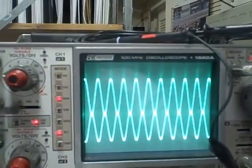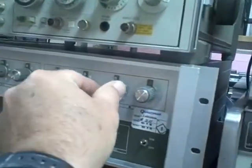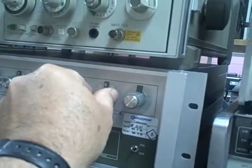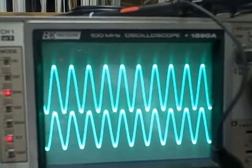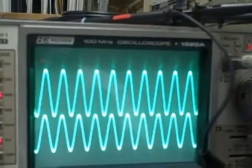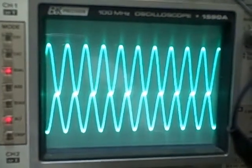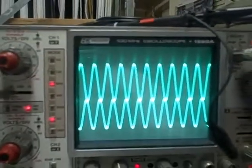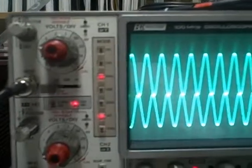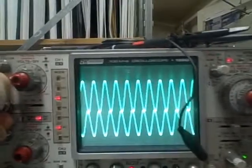As you can see, they are locked at the same frequency. Now I can change the setting on my PTS-500 — let's raise it 1 Hz. There's 1 Hz, and we can see that we are no longer in lock. Channel A is now shifting 1 Hz out of 10 MHz. And I'm going to lock it again. I'm doing this just to show you that I have the 10 MHz frequency coming out of my PTS-500 accurately — the PTS-500 is putting out an accurate signal.